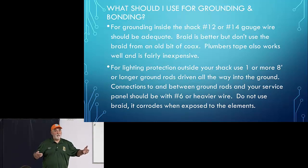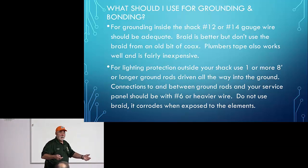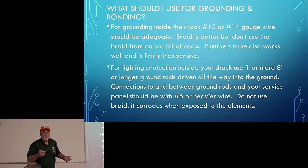And so, yeah, I always just assumed that everything is electrically grounded together on a truck. When I've checked on my truck, I find that it is. The bed of my truck is electrically connected to the frame of my truck, and the bracket that supports my antenna is electrically connected to the bed of my truck. But I did check it. I put an ohmmeter on it and checked it. Another question, Bill?